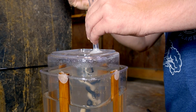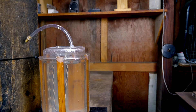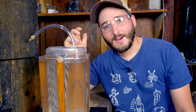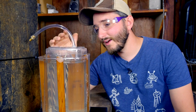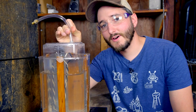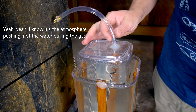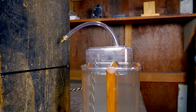So we'll go up to a 50-50 ratio of wood gas to air and see what happens then. And nothing. Okay, so we are going to surpass a 50-50 ratio. Let's go to 75-25. I've just realized I don't actually need a bicycle pump to get air into this system, because all I have to do is lift up on the chamber and then press in the valve stem with my fingernail — the weight of the water pulls air into the chamber. It doesn't actually need to be forced in. Okay, 25% wood gas, 75% air, and we'll test this.